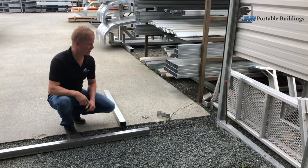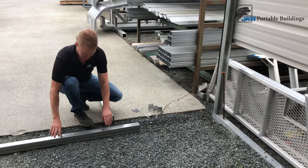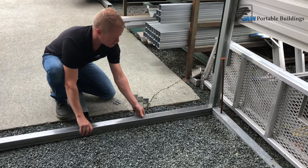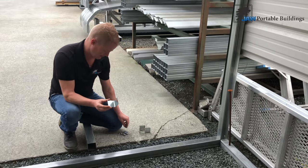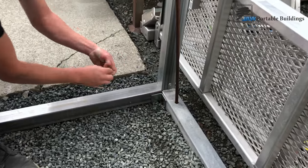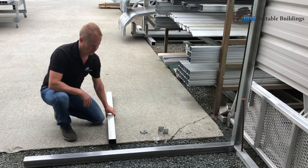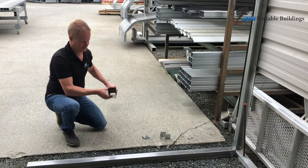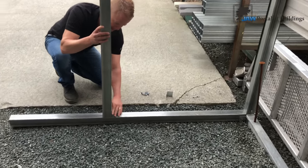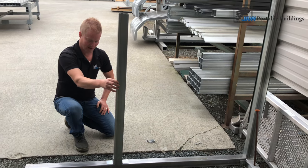So you've got your building up — now it's time to get your rear wall installed. You're going to have your base rail for your back or front wall kit. Slide it in flush with the last rafter, then grab a 90 bracket and two screws and put that bracket right in the corner — one screw on each side. Then get to your studs, your uprights. You've been given enough uprights to do it every four feet. Put your stud on, put a 90 bracket on each side with the same screw pattern, and that's how you frame in your rear wall.